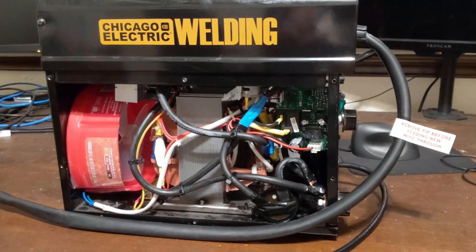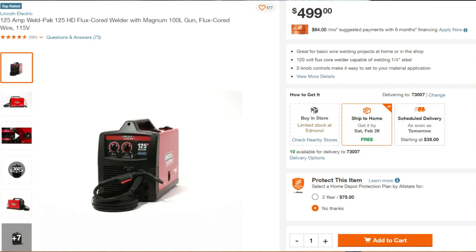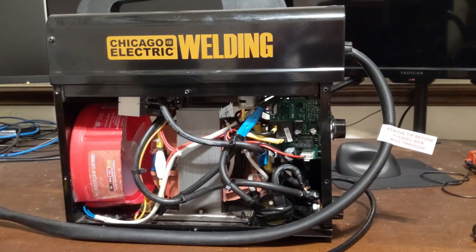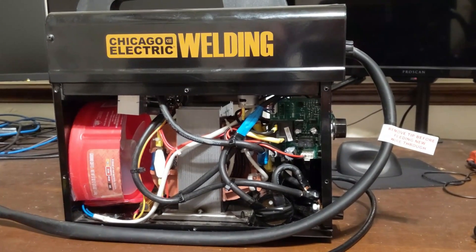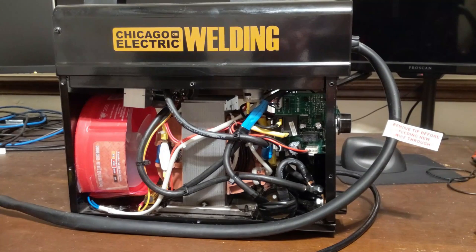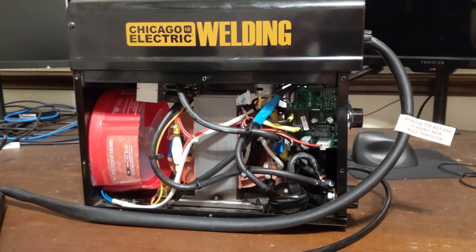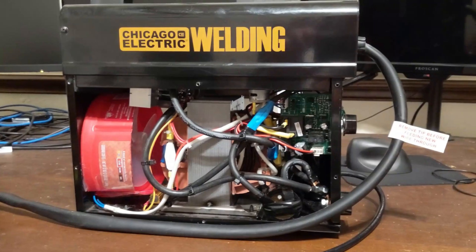The missing components are what really separates this in both cost and capability from a more well-known brand of flux core welder. I discovered this watching YouTube welding tips — everybody doing flux core welding was using a higher-dollar welder and they always said to weld flux core with DC electrode negative, which is the opposite of MIG with shielding gas (electrode positive). Looking into this welder, I discovered it's not electrode positive or negative because it's not DC — it's AC. It's basically just a transformer in a box with a wire feeder. That limits the heat you can put into the metal and causes more spatter, because the current is constantly switching directions 60 times a second.